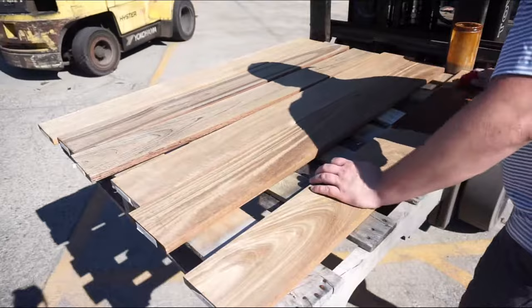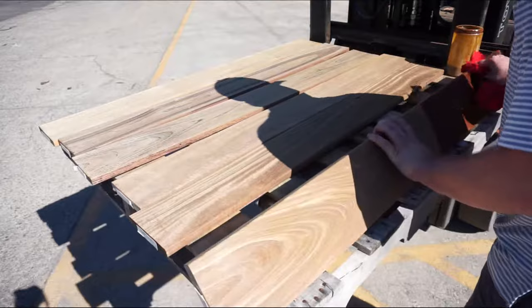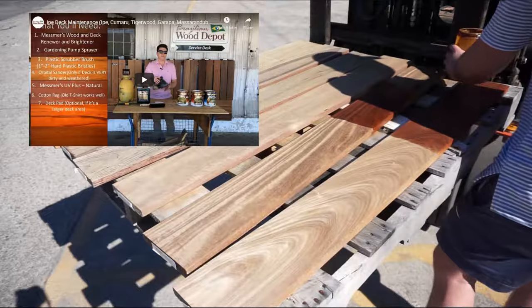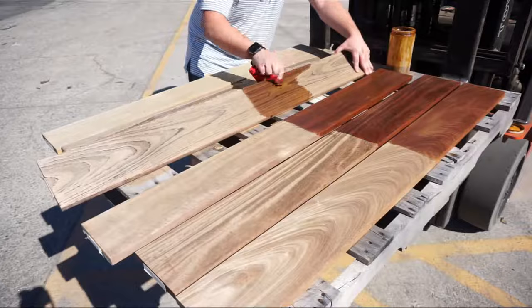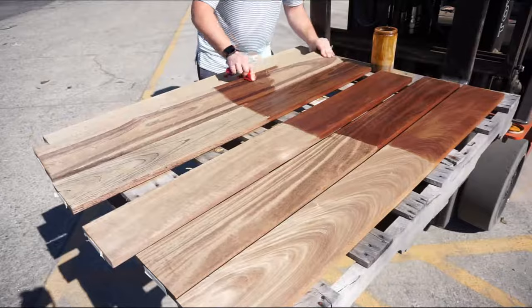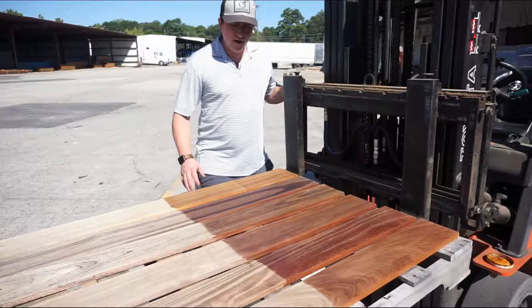All I'm using here is a piece of an old cotton t-shirt. If you're looking for tips and advice on how to maintain your Ipe, Kumaru, or other Brazilian hardwood deck, visit the video I'll put in the description — it's called Ipe Deck Maintenance. It's about 15 minutes long and goes through different stages a deck might be in so you can clean and oil it effectively. If it's a larger deck, I'd recommend using something like a Deck Pad, or there's a product on Amazon called Deck Boss — it's basically an oversized paintbrush head that helps get between the boards. What you don't want to use when oiling your deck is a roller — it just puts on too much.